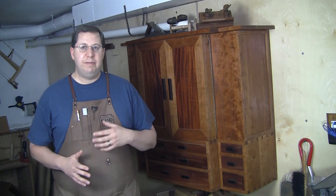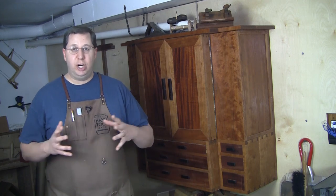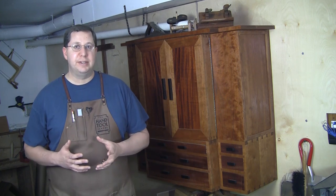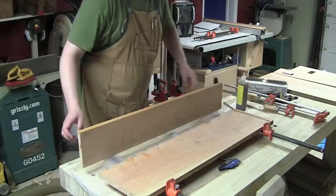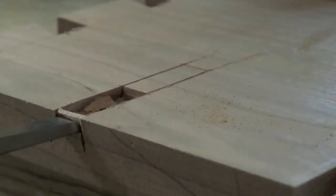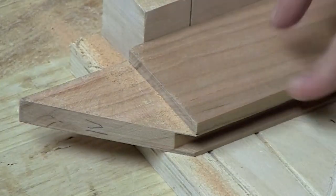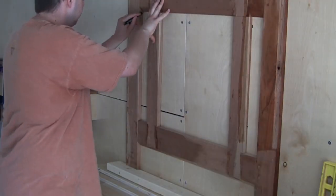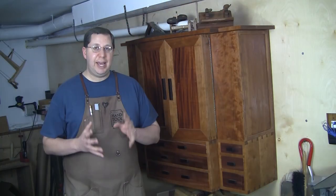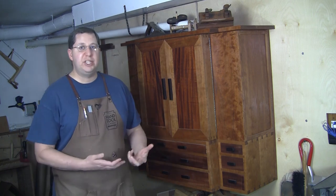After you've learned all the fundamentals of plane craft, sawing, and chisel work, and applied them on a variety of bench appliances and shop aids, you take all those shop aids, all those tools, and all of those experiences and sink them into building this tool cabinet. You'll break down rough stock with your saws and saw bench, then mill up and glue together case panels and dovetail them together. You'll use sliding dovetails for the drawer blades and dados for the runners and internal dividers. You'll leverage your experience with miters, grooves, half laps, and dovetails to make clamshell doors. You'll make dovetail drawers with veneered fronts and use mortise and tenon to craft a bomb-proofed French cleat to hang the whole cabinet. Literally every technique and tool that we build and discuss in this semester gets used to build this tool cabinet — it's truly the culmination of everything we've talked about.